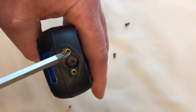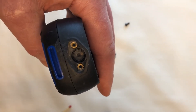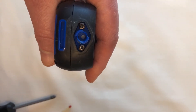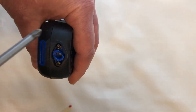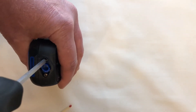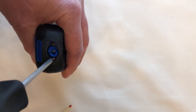Ensure that the O-ring seal is still located and looks in good condition in the casing of the PS200. Now we can refit the inlet nozzle. The inlet nozzle is molded to fit in one direction only — make sure that the orientation is correct and the nozzle locates easily into the instrument front cover inlet. It is easier to place the screws into the inlet housing before fitting it into the casing. Fit then tighten the two Posi-pan screws using the number one Posi-Drive screwdriver. Ensure you do not over-tighten the screws as this could cause damage to the casing.